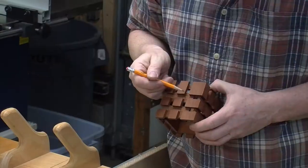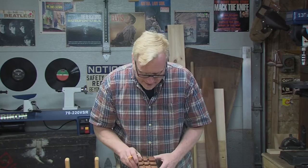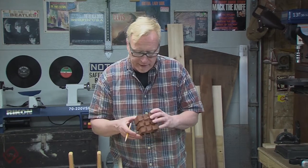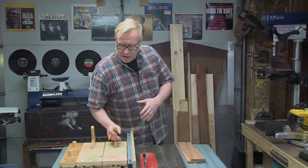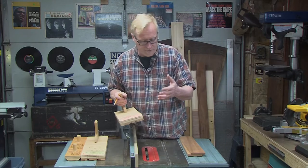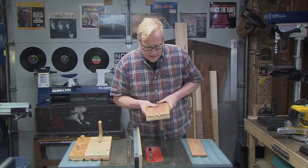I cut a series of grooves and dados. Some are cut at the same dimension and then I move the fence over and cut them at a different dimension on the front and back face. Some cuts go straight through and others overlap, cutting perforations that let the light go through. I've used them outside and the wind doesn't even blow them out, but on a dining room table they look really nice. I've made up a series of jigs — it took a little time but it's not that complicated. It's basically a sled that gives me control to cut a series of dados and grooves. You put your board in — not super tight, not too sloppy.